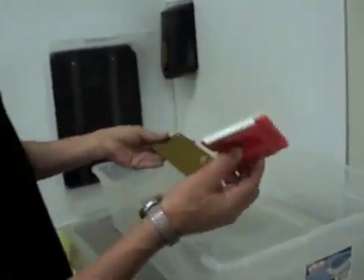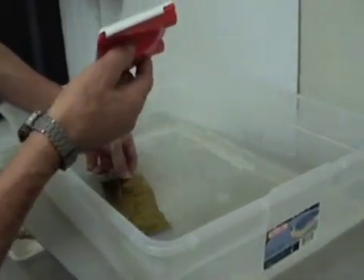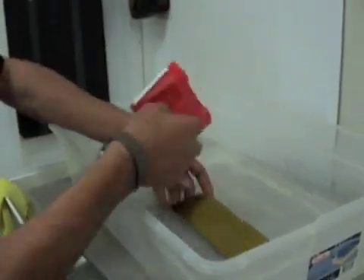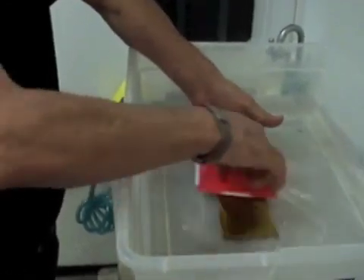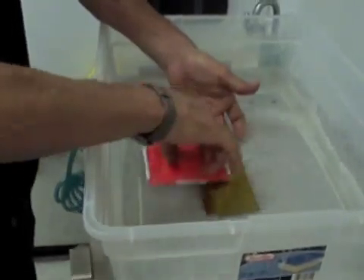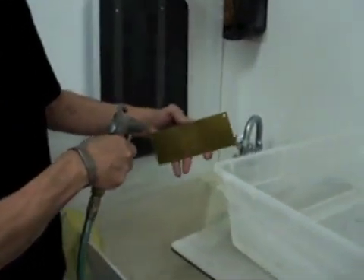This is what you're going to brush it with — this is a de-brush, what we call the de-brush. I have it in the water and I'm just agitating it, keeping track of my time. Okay, that was 45 seconds — now we're just going to lightly brush it in a figure-eight or circle motion for 15 seconds and you're done. Now you're going to blow it off with some air — not a lot of air pressure, just enough to get the water off.